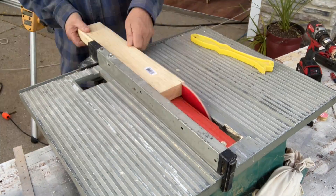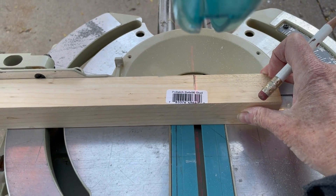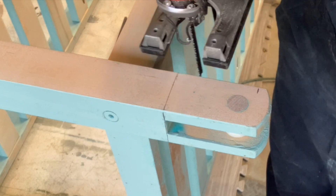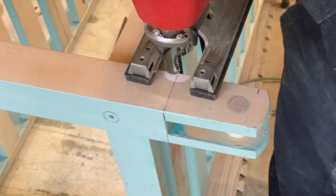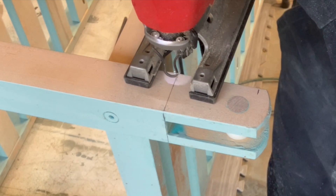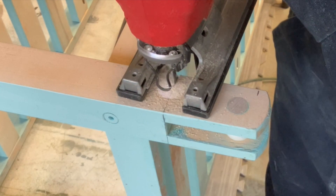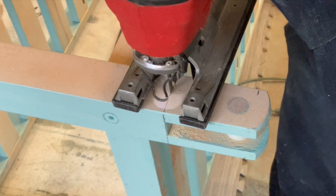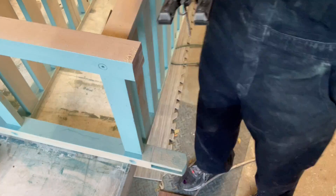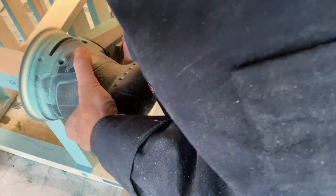This piece that Phil is cutting is for the bottom where I'm going to add the wheels. Now speaking of the wheels, I need to use the jigsaw to cut off that little part where the wheel went. You may have noticed that I started the jigsaw before I hit the wood — you always want to do that. You don't want to start the jigsaw when it's butted up against the wood because it could kick back.